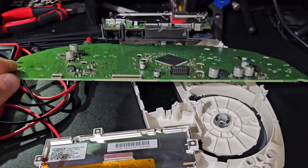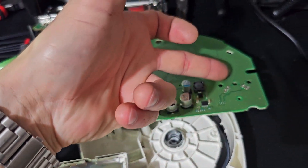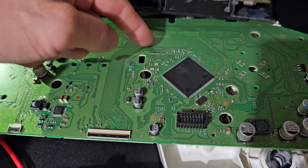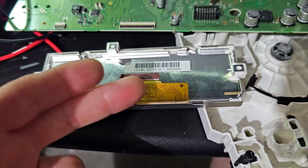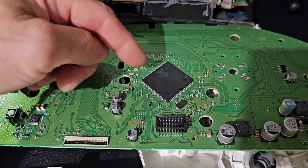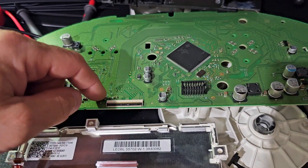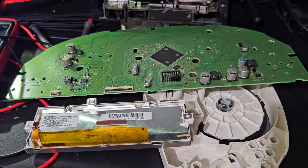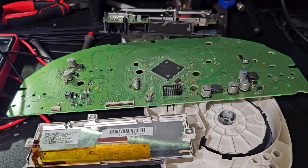The disadvantage is I have this big board that I need to mount on the car. My idea was maybe I can cut the board here, because everything in this section — all these lines — are for the image of the LCD, which is no longer used. But there's a problem: I don't know if inside the board there's a trace for the processor that winds around to avoid other traces, and when I cut it, I'd break that trace. So for now, I'll leave it and maybe I'll have another idea, or some of you will give me one.